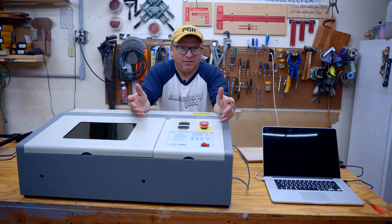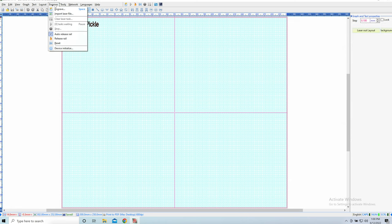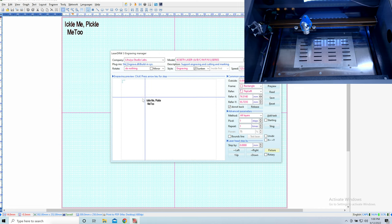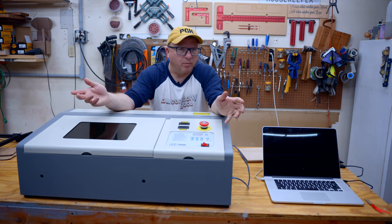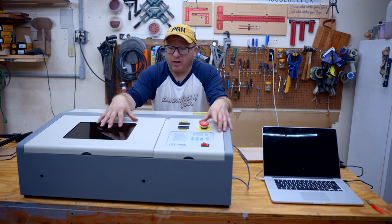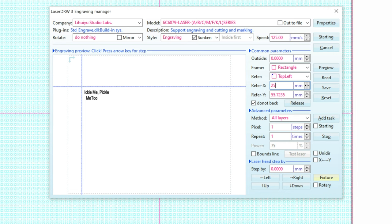The fact that it actually works in Windows 10 on a virtual machine on my Mac connecting over USB is astounding. But the user interface is just very hard to understand. You do some layout on a canvas like you'd expect, and then to do engraving it opens another window showing your canvas relative to your machine. You can jog the machine with a little pinpoint, but it doesn't really tell you what the outline of the machine is, so you don't really know where you're placing the head precisely. There's no laser alignment on this specific unit — you can get one of the units with a laser alignment dot, which I would highly recommend. If you want to do precise cuts repeatedly in the same place, it's really hard to do. I recommend creating some sort of jig that you stick inside.